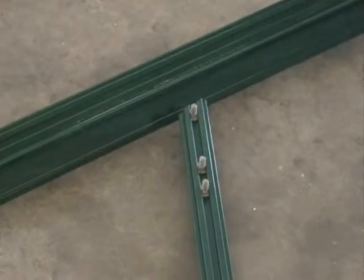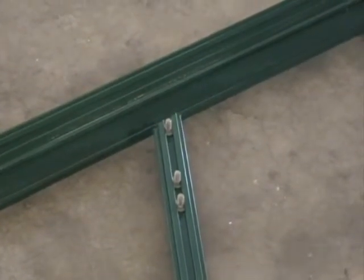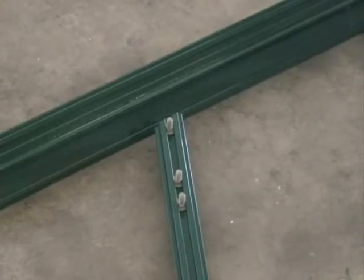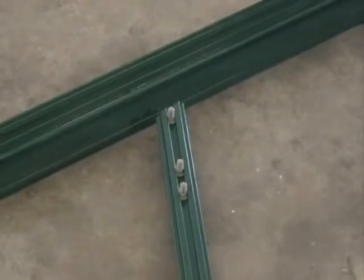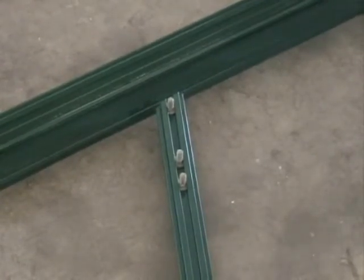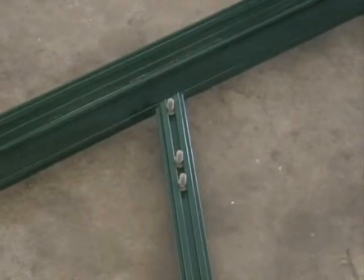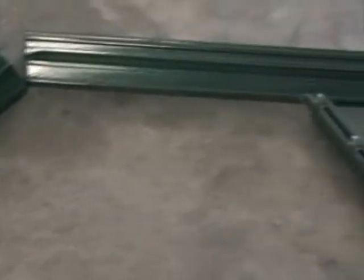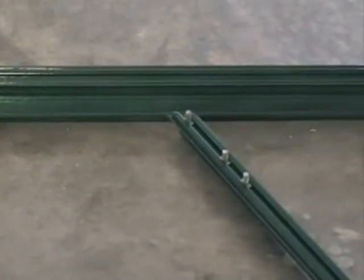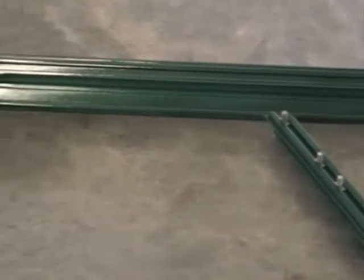The first T-bolt is the one that will connect again the top corner bar to the glazing bar. The second one will be used for connection of the fan bracket, which we'll show at a later time, if this comes with your kit. The third T-bolt will be used for the cross brace. Now if your unit comes without the fan, you will only install 2 T-bolts into these slots, the same as you did on the 2 outside.